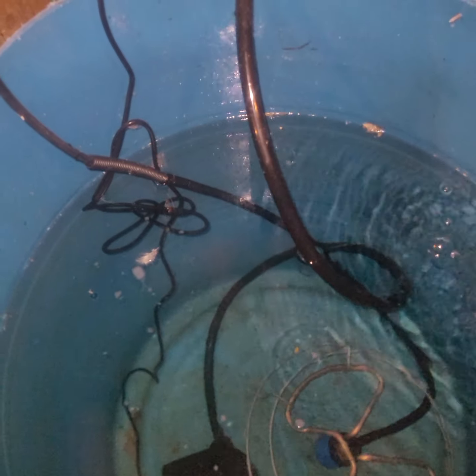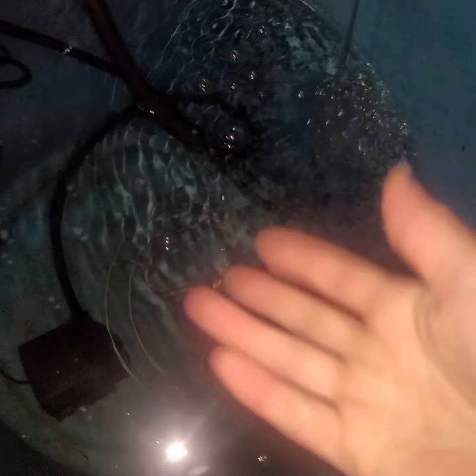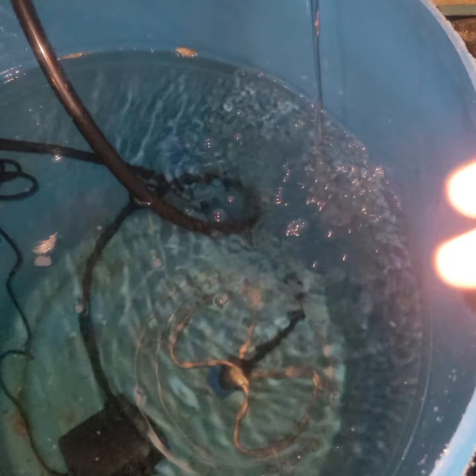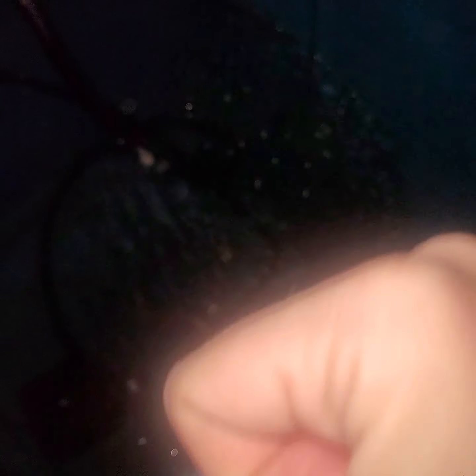You can see the pump is over here — it's an aquarium pump, or actually a pond fountain pump. It is intended to be submerged and will automatically turn itself off if the water drops too low. On the right here you can see the stock tank heater. It will also automatically turn off if the water level drops too low. In the summer I do unplug it, but on warm days — like Saturday when it's supposed to get up to 50 degrees — I don't have to, because as soon as the water temp hits 37 it turns off, and when it drops below about 35 it turns back on. On really cold days you can actually feel the heat coming up off the water.